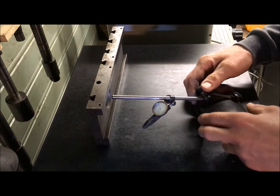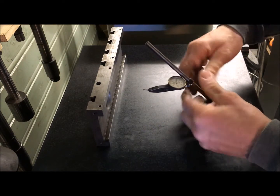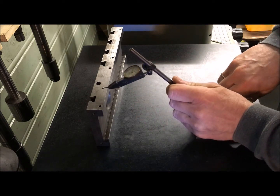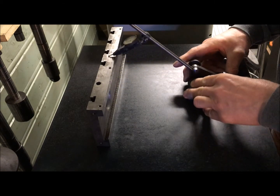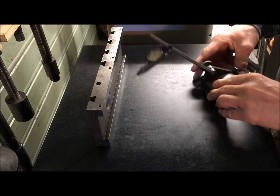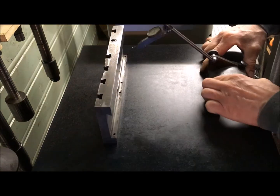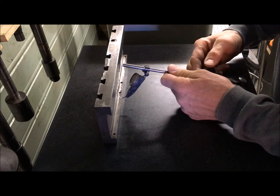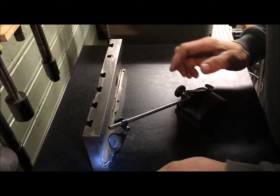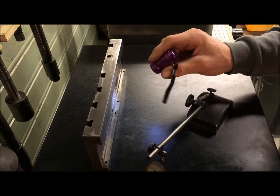I can do that by first of all stoning them to see that there are no surprises. This surface should be in plane, and then I can also just as a test take this surface into account — practically zero, within one hundredth of a millimeter.